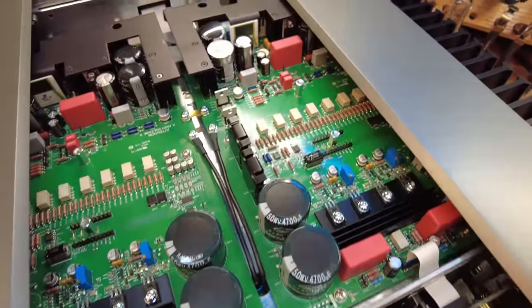Here's a close-up of the relay I took earlier — it's also the type they use on the input selection board, so the same relays are used for both volume control and input selection. They are AXICOM signal relays. The spec sheet confirms the configuration and gold plating used on the contact points — it's a signal relay, the appropriate type for these low-voltage applications. The coolest thing is it comes in bi-stable format, which is essentially a latching relay: rather than continuously providing power to maintain the volume position, they invert the voltage to flip it from one state to the other. That's why we hear all the clicking, and how they maintain it so quiet — the relays are not energized all the time.